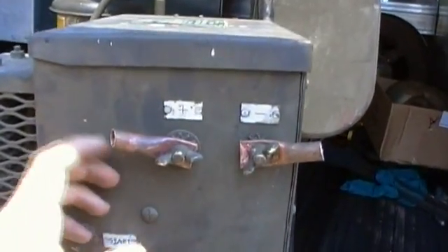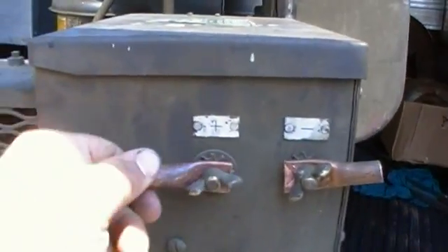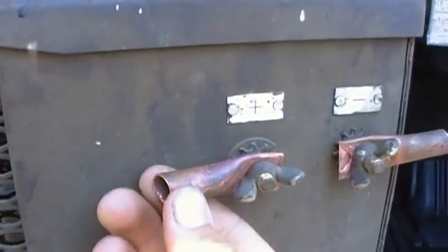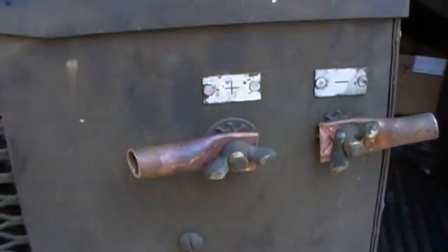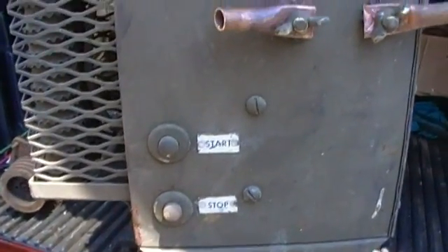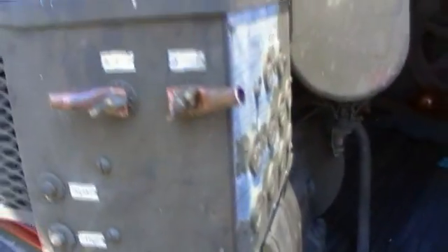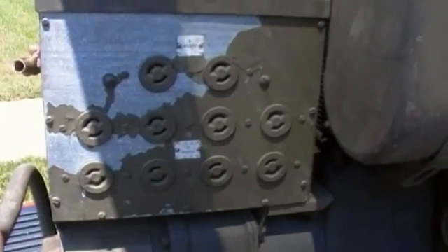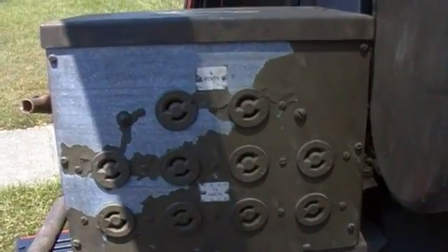Let me spin it around. It's not real heavy. You can see the two terminals — positive and negative. I'm not sure if these are original, these two lugs. They appear to be just copper water pipe, cut and sandwiched on one end, and you put a wire in there and crimp it. If you have a 12-volt battery, it can be started with a battery or a rope start. It has 6 or 12 volt output — two receptacles for 6 volts and eight for 12-volt output.